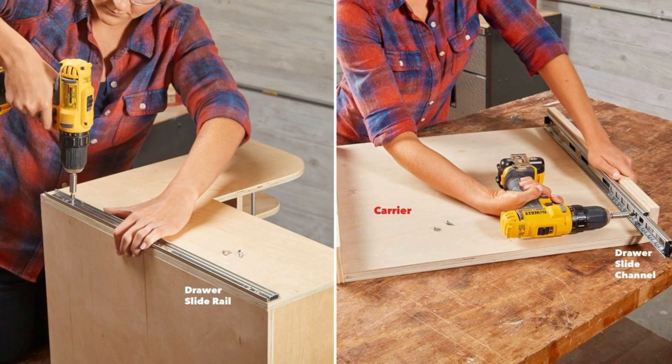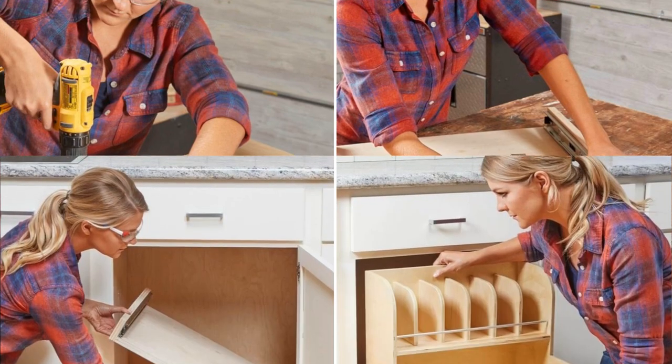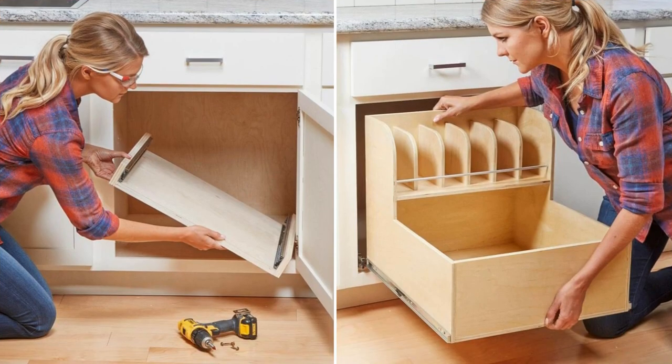Trim the sides after modifying components B, C, D, and E for cabinet width, cutting off all but the carrier bottom. Make L-shaped cuts with a table saw, but stop an inch short of your inside corner lines.